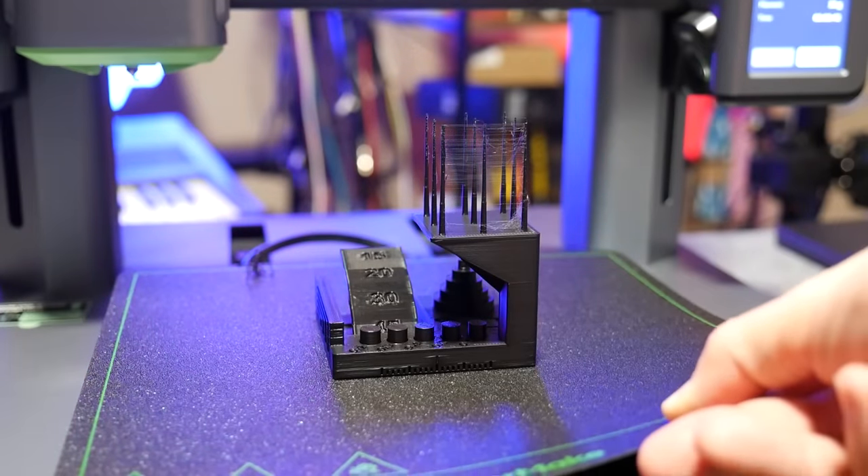And then there's the AI error detection camera. It works, but it also doesn't work. Initially, this machine was sending tons of false alarms through the app as push notifications, which was really annoying and I disabled it. But with the latest update, it does enable AI monitoring of G-code sliced from PrusaSlicer, Cura, or their own slicer. It does this thing where it checks the first layers by pulling the gantry up and letting the camera look at the print bed to see if the first layer is correct — and this does work. I tested it with a bad first layer and it gave me a warning. But after the print continued past the first few layers, it did nothing — nothing I could do would trigger the AI detection. I tried covering the camera, chucking filament onto the print volume, and deliberately having prints fail. Some error detection is better than nothing, but maybe it'll get better in future.